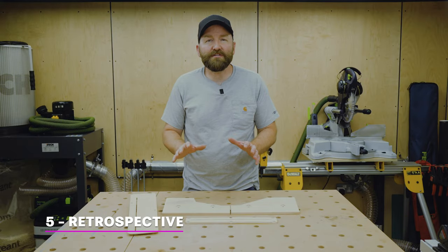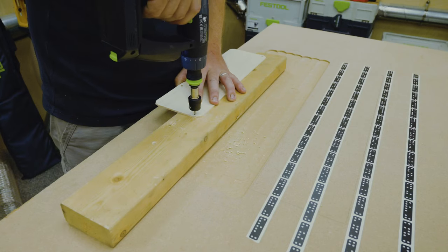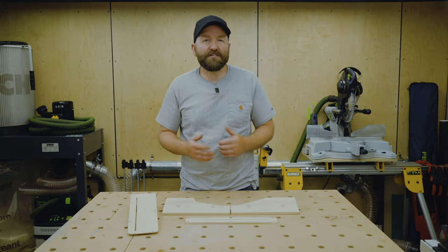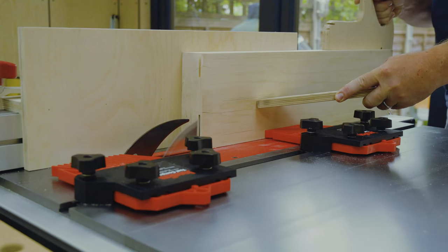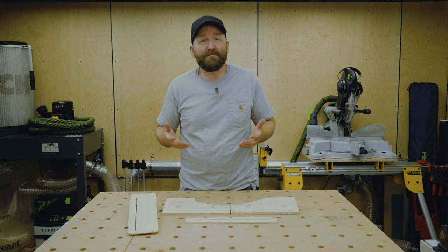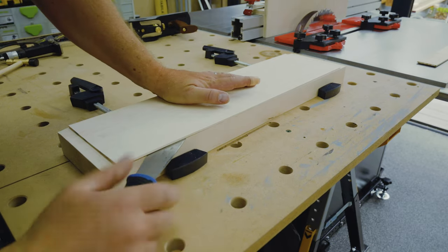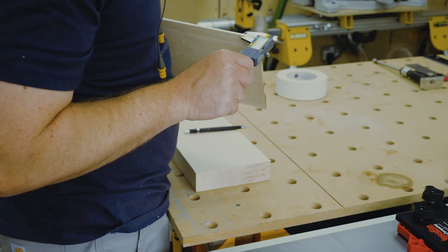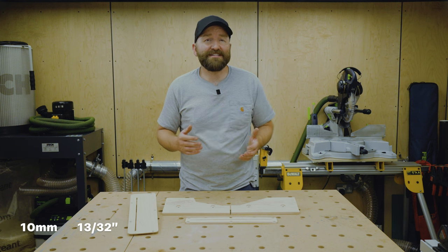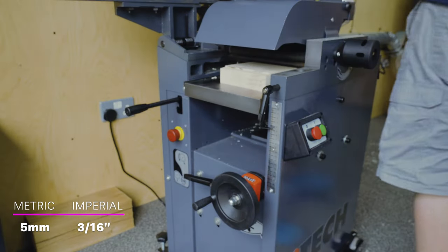My three zero clearance parts are done and fit well on both machines. I think I was able to pull off the techniques needed to get a good result. When I inevitably need to make replacements I will do things a little differently. The auxiliary fence and feather board combo works really well. The issue I had was that the re-sawn boards immediately cupped and twisted, and although I went over thickness anticipating this, I didn't leave enough to do remilling properly. I would suggest not re-sawing to a thickness of less than 10mm and leaving yourself at least 5mm for remilling.